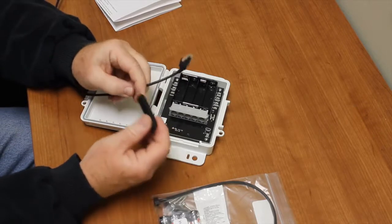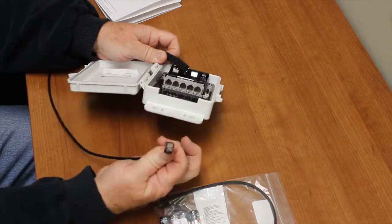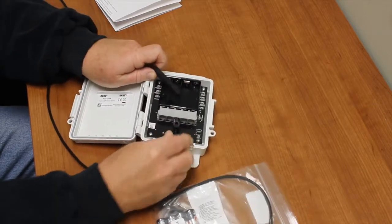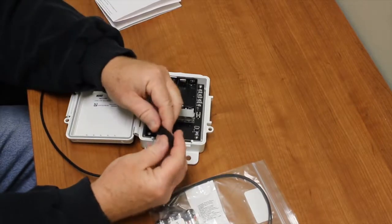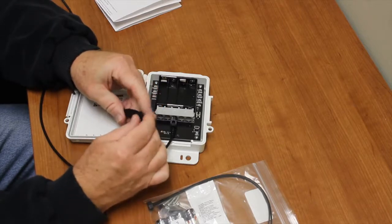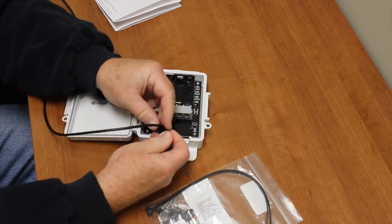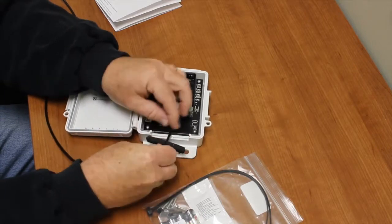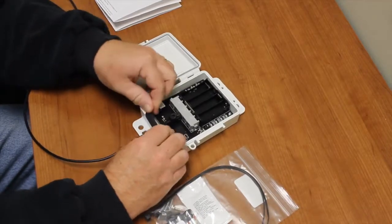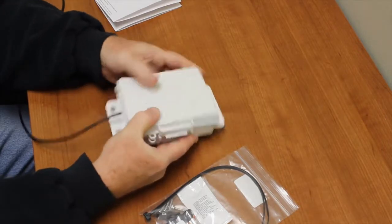I have a smart sensor cable here. Here are the five smart sensor jacks in the bottom of the data logger. They plug into the standard RJ12 smart sensor connector on the end of the smart sensor — any of our smart sensors, you just pop it in like that. To get it into the cable gland, put a little silicone grease on the cable or around the gland so it slides in better, also around the perimeter of the gland. You just spread it apart, pop the cable in, close it up, and slide it into that channel. Make sure to get it down in there nice and tight, and when we close the top you'll see it gets pushed down into place.